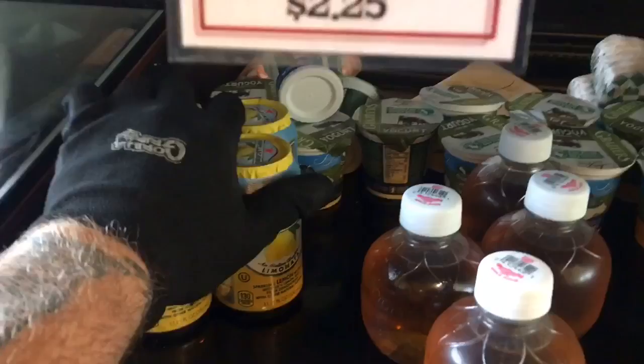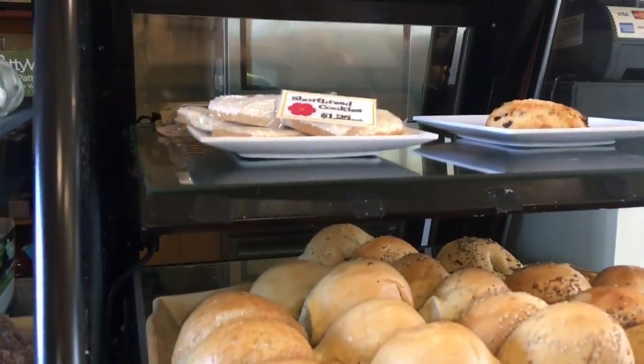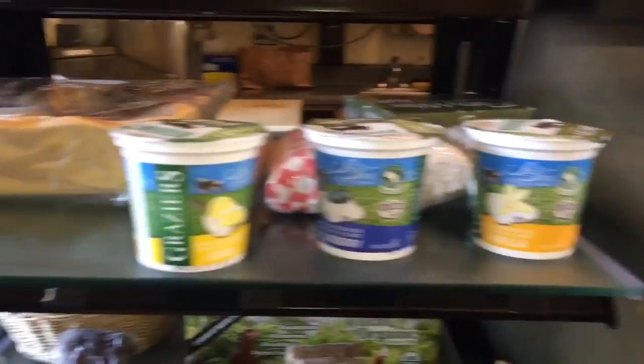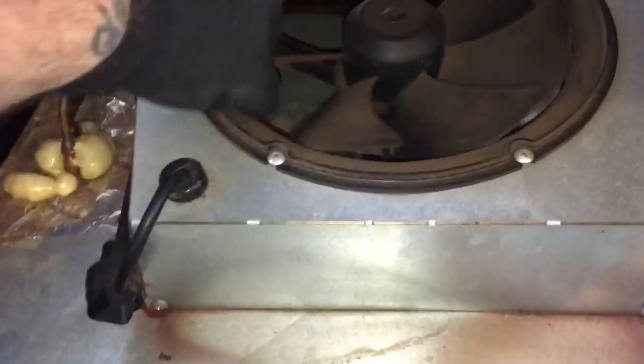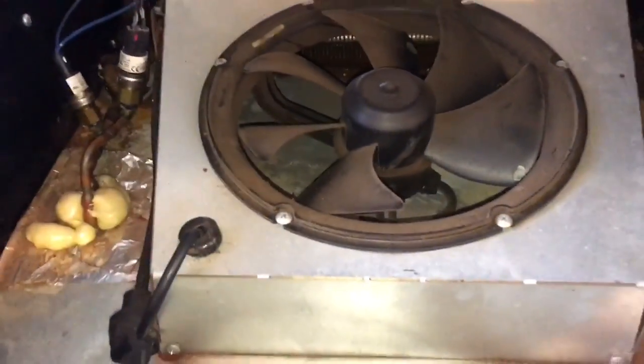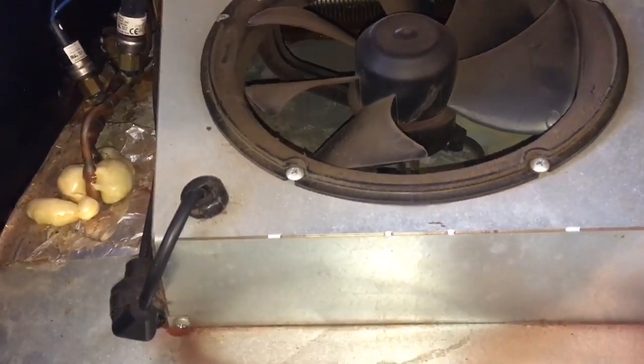Let's get the case emptied. Just on the bottom right here. There's the original evaporator fan. So what you have is a cold side and a dry side to the case. This part of the case is the cold side, and this side is the dry side. So what happened was the fan blade broke, but they don't make this anymore, so you've got to get this whole kit to redo this.